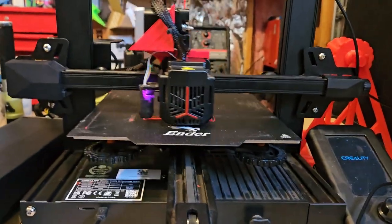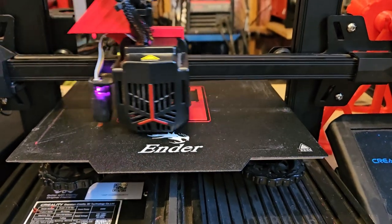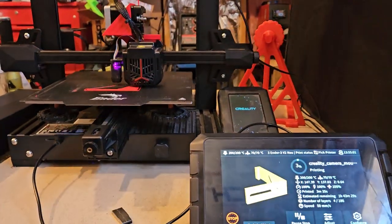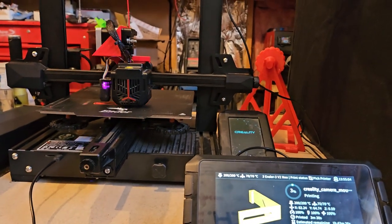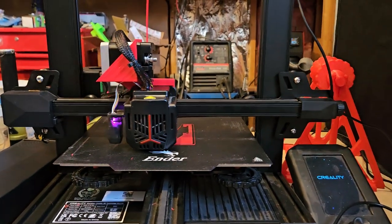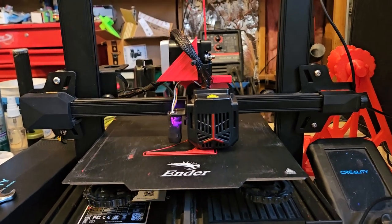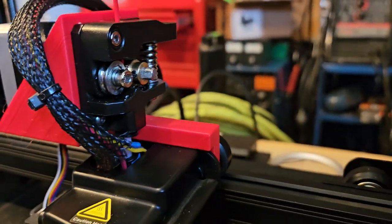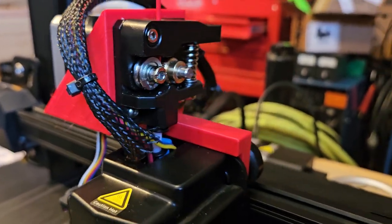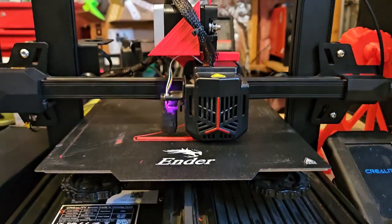I don't know if it's going to screw up because I saw it print two little spots that didn't look good, and I can see a spot right now that doesn't look great. But look at it — it is moving, and it still says it's only 67. It must be the extrusion speed more than anything. We have the speed the print head moves and the speed the extruder extrudes, but it seems to be doing everything faster, which is pretty cool.